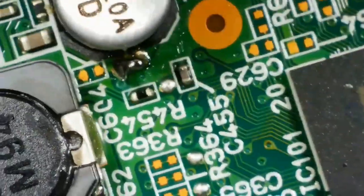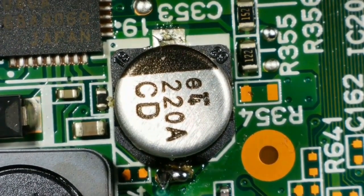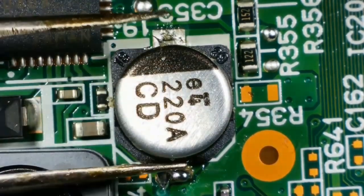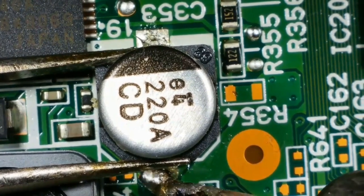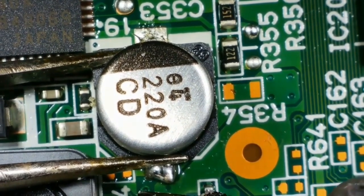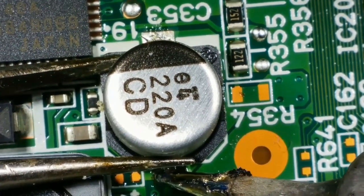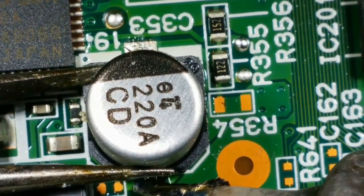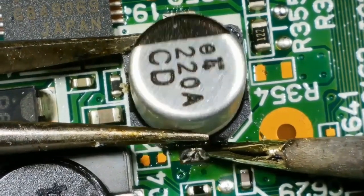First, I drop down a good amount of lead onto one of the legs. Then I turn my main board sideways so I have that leg facing me with all the lead. I take some tweezers and give them a good click to make sure they work. Then I hold onto the capacitor and warm back up the lead I dropped. I slowly start tipping the capacitor back towards the leg with no lead, which releases that first leg. It slowly raises up and then you'll see that leg pop off, though it's still attached by the leg in the back.